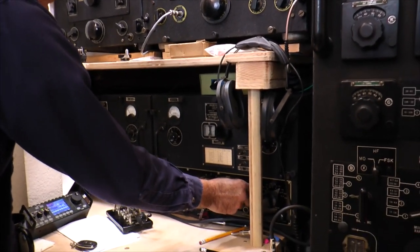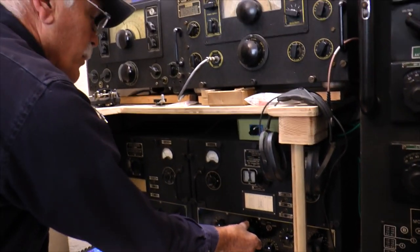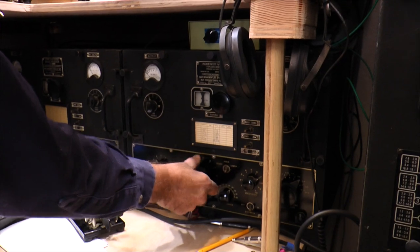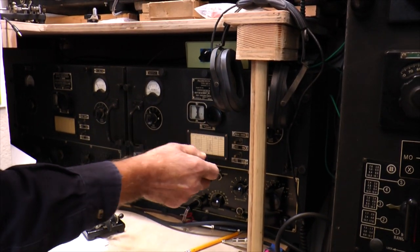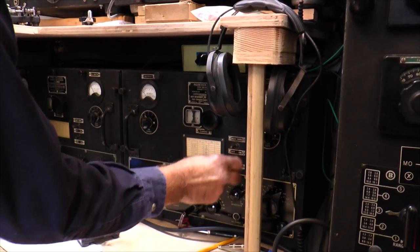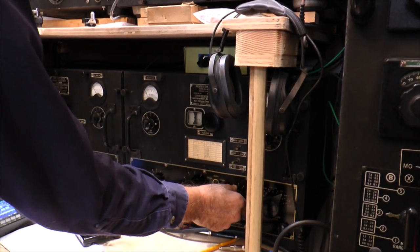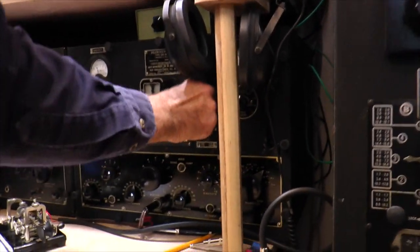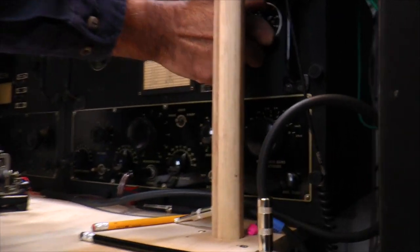If you want really sharp, the only selectivity the radio has is if you just fine tune that regen to just on the edge of regen. There you're maybe 50 kc wide, which is about as sharp as it's going to get. You can cut in some of the step tunable audio filters up here.